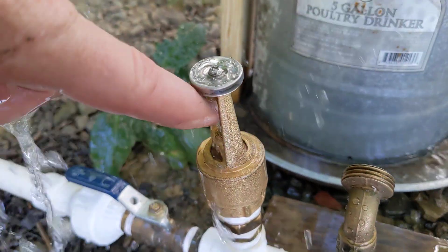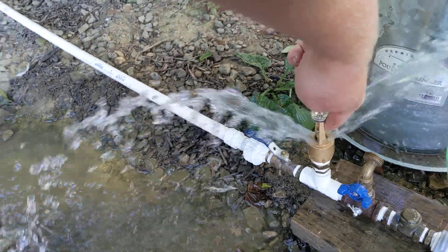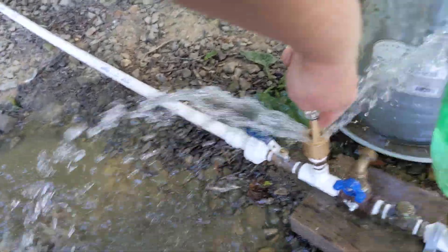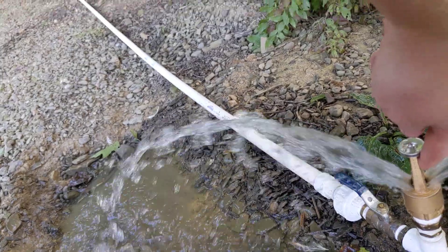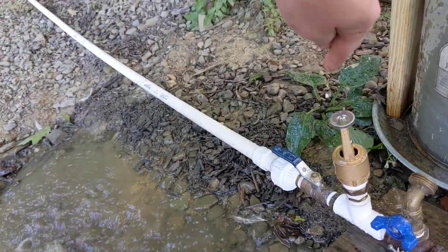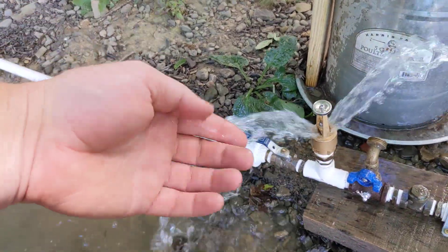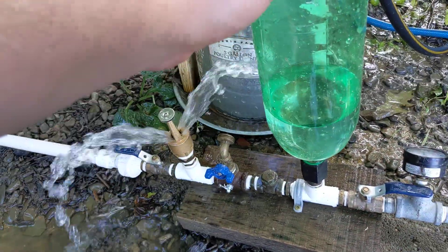This allows the water velocity — if you hold it down, you can see there's a lot of water shooting out. That is representative of the velocity of the water in there, and then when that shuts, all of that velocity of the water has to go somewhere, so it goes through the check valve and into the buffer tank.